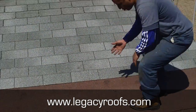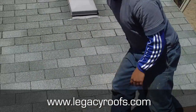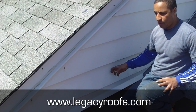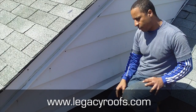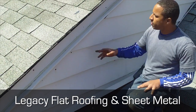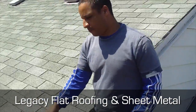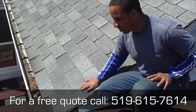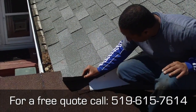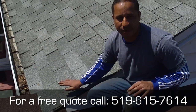Overall, the most important detail was how we tied that shingle-to-flat-roof transition in. We had to add some extra drip flashing here — the old wood siding detail was a bit suspect the way it was done before, so we fixed that up nicely and caulked some suspect areas. Remember how this was all exposed from under the shingles down? Now it's all nice and weathertight — base and cap sheet in, flashing done nicely.